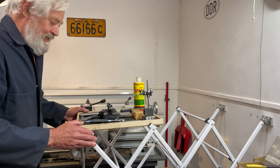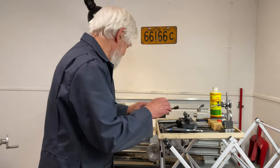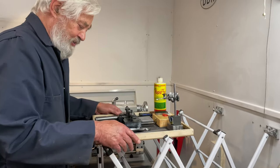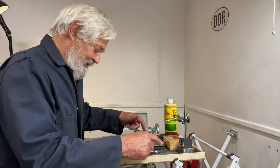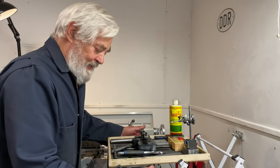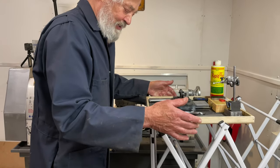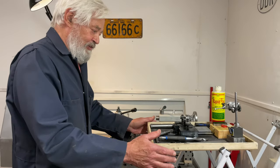I adapted it — in this case I mounted it horizontally — so that I can bring it out horizontally, quite far actually, further than I really need to, but you can see that. And it's quite sturdy. I use it because it supports my tray for the tools that I need when I'm doing lathe work. You can see how the scissor mechanism is really quite simple and it's very good in this direction, at right angles to the extension of the scissor. This particular mechanism is really two sets of scissor arms, left and right, and they are stiffened with cross members so that you don't get any of that kind of movement. It's not meant to go up and down — it's only meant to go in and out.